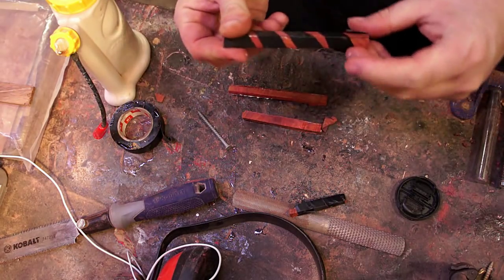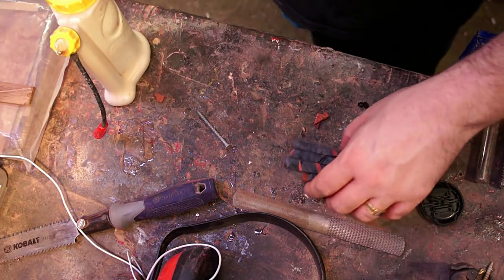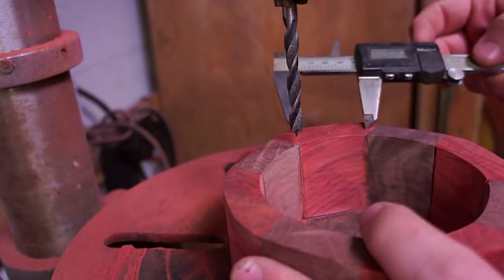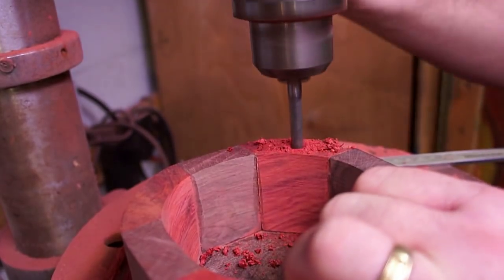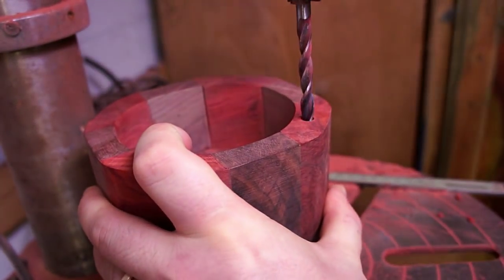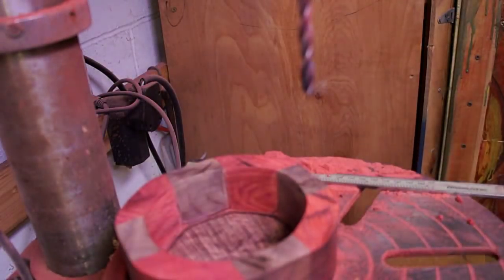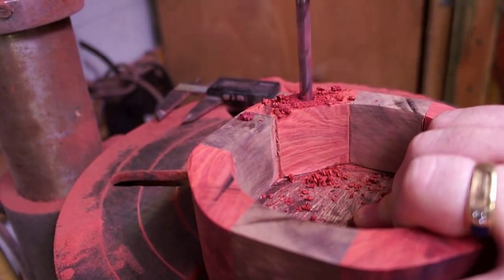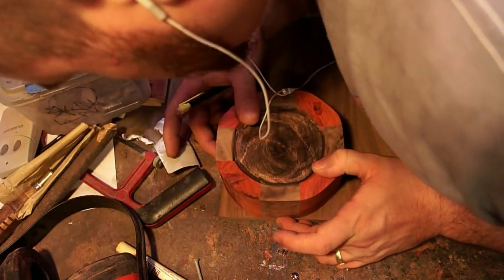Something I think is kind of highly underrated as a wood clamp is electrical tape. I use this all the time for little tiny pieces like this — it's more than enough force and you can get them exactly how you want to position them and just stretch it out. For the design I'm using, I wanted all three pieces to be able to move independently: the pepper, the salt, and the top. Right here I'm centering the hole in that piece of wood and drilling a cavity down through the top. Then since I need it to match up exactly, I flip that around, stick it on there, line it up, and put the drill bit through it — I push it down enough so the brad just makes a little indentation on the bottom part. That gives me a little index point I can reference my drilling off of, ensuring everything gets completely lined up. And when you almost get to the very bottom, you always flip it over to avoid tear-out, or put a little bit of masking tape over it.